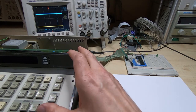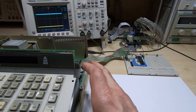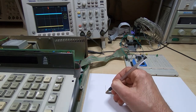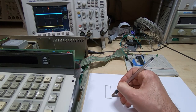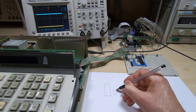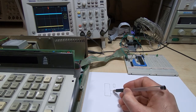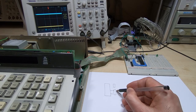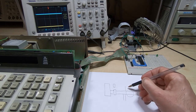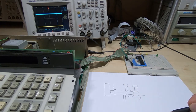That said, the 9010A has a design characteristic that I think makes it a very poor design. And overall it's a good design, but there's a particular characteristic. Now, when you design a microprocessor system, what you normally have is your central CPU, and one of the first things you do when you're working out your design is you insert buffers between the CPU and your main bus. So for example, your data bus would pass through a bidirectional buffer, and then you would generate an external data bus, and that is what you would hook everything else to. So all your ancillary circuits would be branched off this, possibly through their own buffers as well.